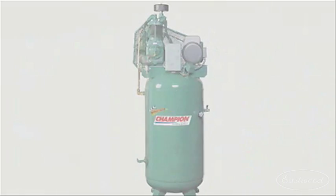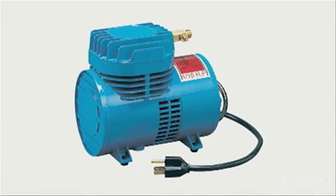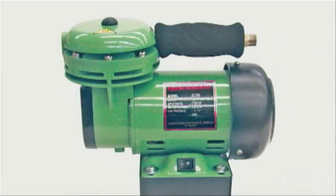Second, you'll need an air supply source for the gun. From large projects to small, the hot coat gun requires very little air — just 0.5 CFM at 5–8 PSI works fine. You can even use a portable air tank with regulator.